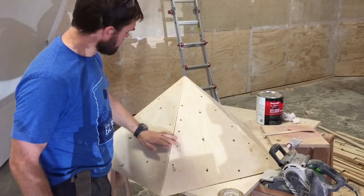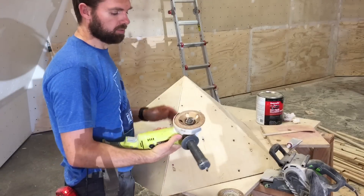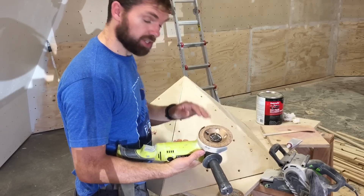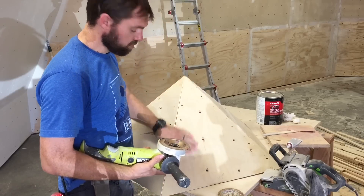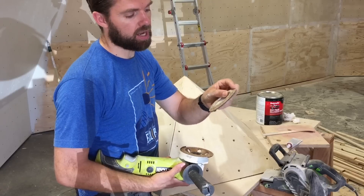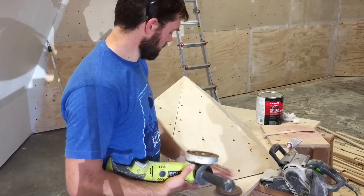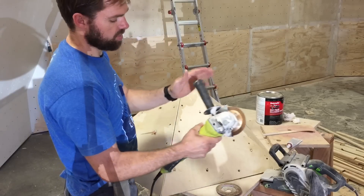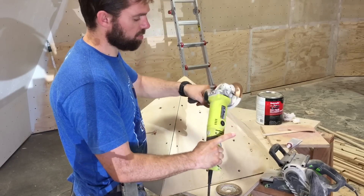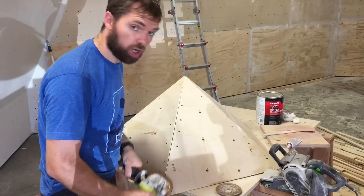So you can use two different tools to grind these edges down. You can use an angle grinder. This is a disc specially for carving wood and it is very aggressive. When you're just smoothing this out, you don't want to use this disc — you want to use what's called a flap disc. It has little pieces of sandpaper that are glued to a disc. You're going to come in and use both handles, because that's going to help you get a little bit more stability with the tool instead of just using one.